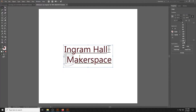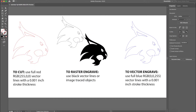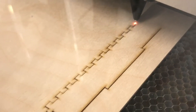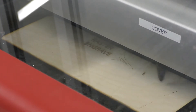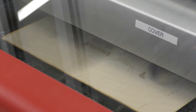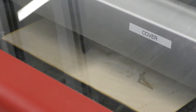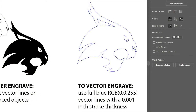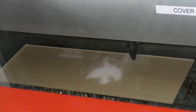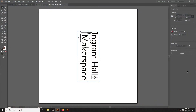When it comes to Adobe Illustrator, the colors and line thickness matter. For example, red lines are intended for vector cutting, where the laser follows the path of the line and is at full cutting power. However, if the item is black, then it will be raster engraved — this is when the laser head scans back and forth above your design and engraves the material line by line. If you are engraving simple lines, it is recommended to change your vector lines to blue to vector engrave. Vector engraving is similar to vector cutting in that it follows the path of the line, but will not go all the way through the part. Make sure your colors and line thickness match the correct settings in order to have a successful project.